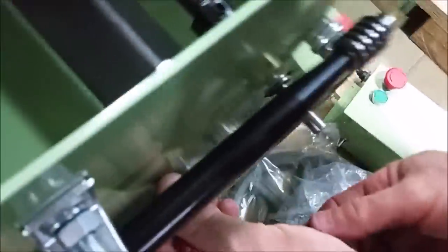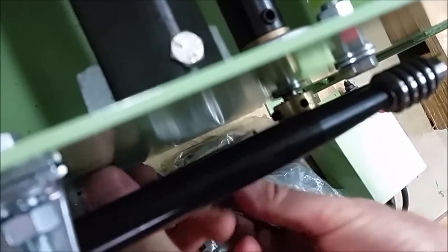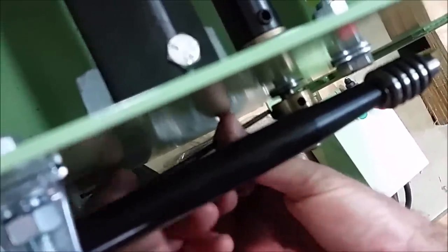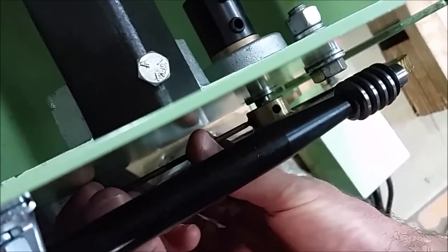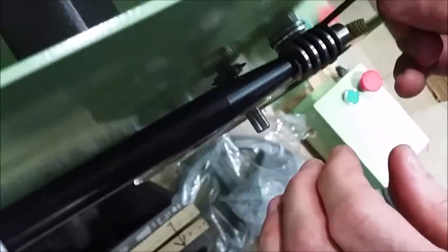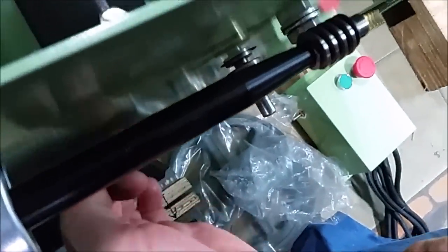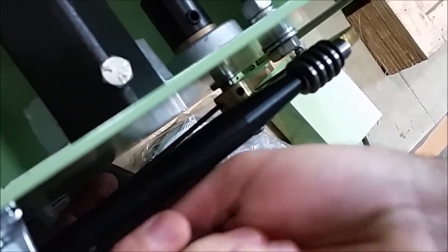I'll come back with my second screw and snug it up a little bit. On the bigger gears there are two screws; smaller gears usually only have one, just because there isn't that much force on the gear since it's driving a thread and can generate a lot of power to push. When I get close, I get on here and crank it down so I don't have to worry about it coming loose, and I'm just putting this little wrench on here and cranking it down.